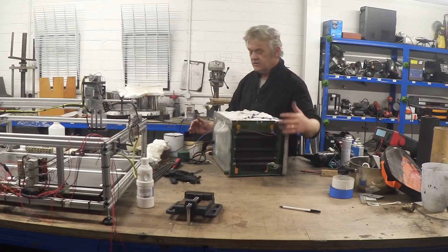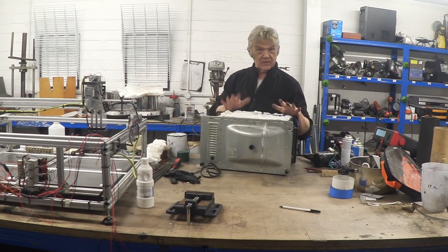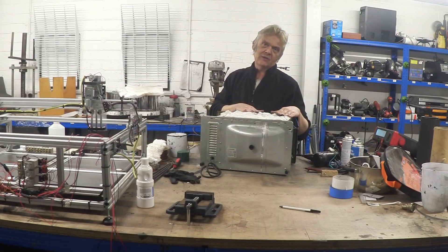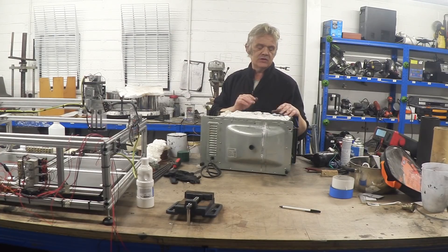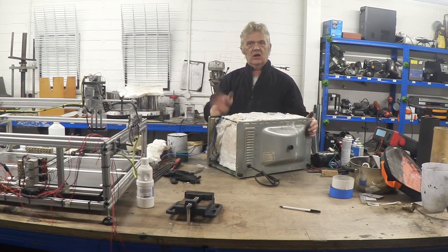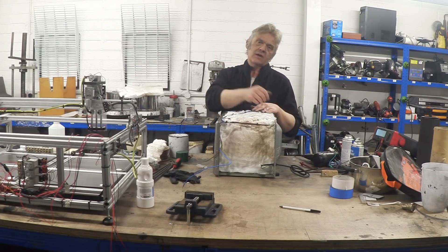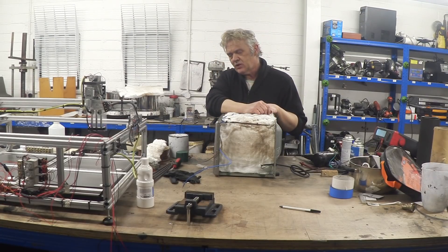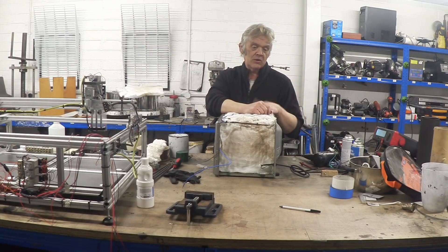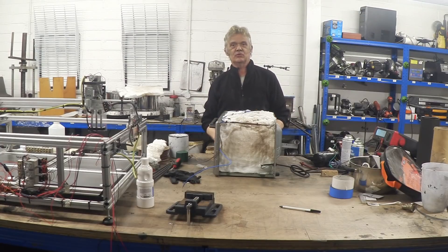Here is a side of it painted with our ink, and I've also put insulation blanket around it — which is incidentally why the wires were standing high. You're not allowed to get wires hot; if you do, you derate them, and it's quite dramatic how much they derate. So as much as possible you leave the wires on the outside of the insulation. I've got the insulation blanket all the way around apart from this side, which I'll do now. What I really need is some kind of temperature control, then the top goes back on and it's finished.